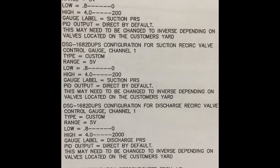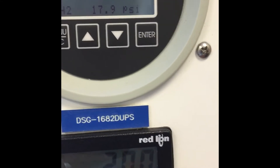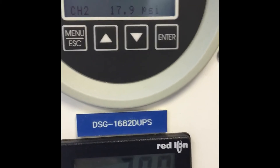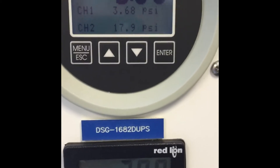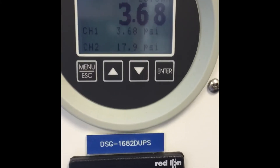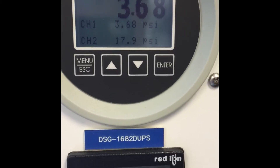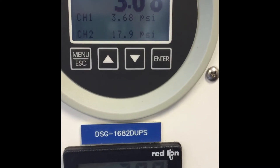But I'm going to show you the menu systems. For our test purpose, we have a 4 to 20 milliamp measuring device hooked up to this gauge measuring the current loop on the outside of it. This can be emulated with any digital volt ohm meter used in the 4 to 20 milliamp scale DC.